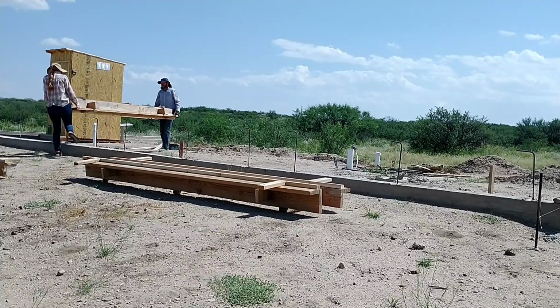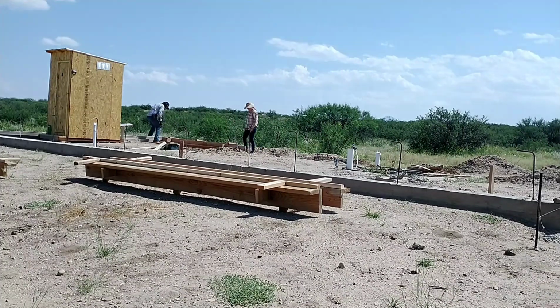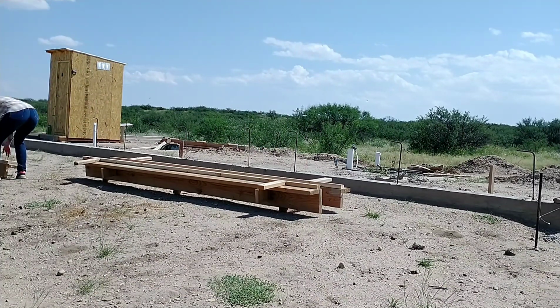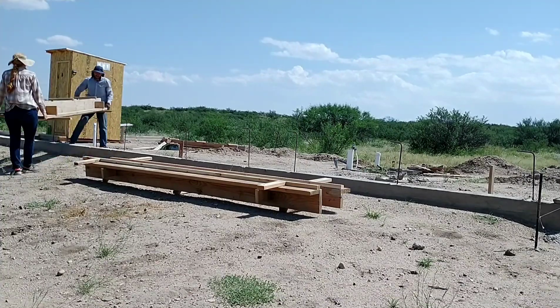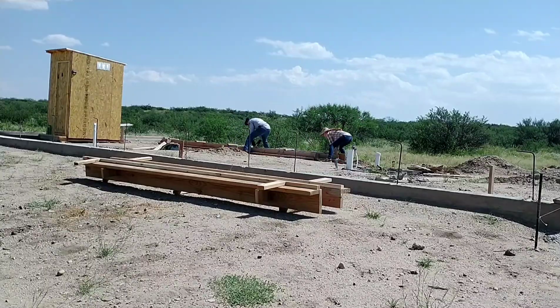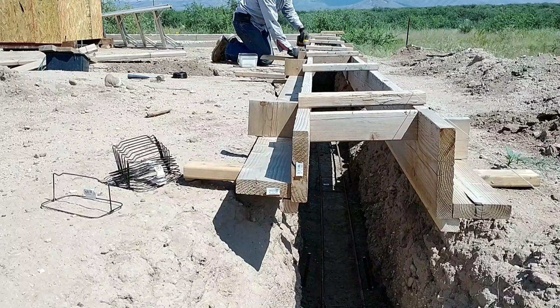Anyway, I went ahead and bought some OSB and used that to board in the sides all the way down to the bottom of the trench. Once I had the forms rebuilt and ready to go, including that 2-inch board along the bottom that I would hook the plywood skirting to, I was ready to go and get started placing them.